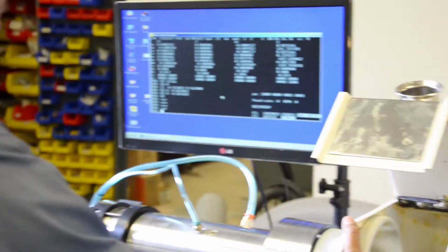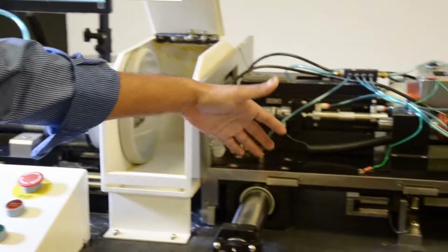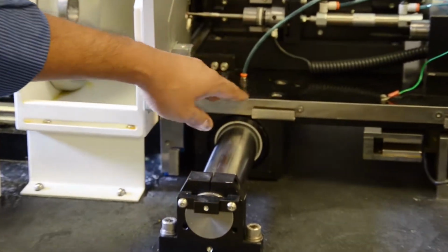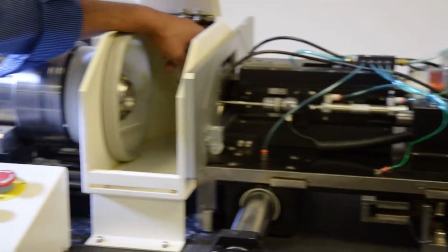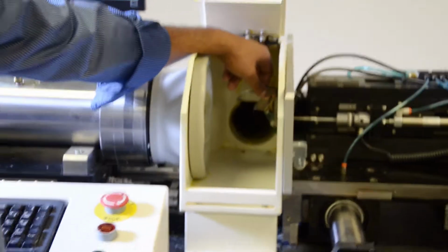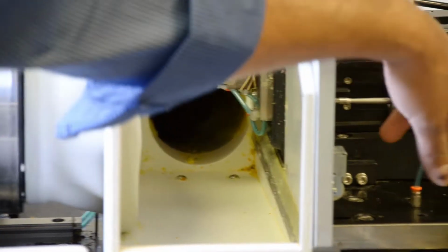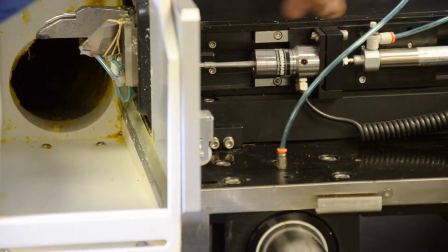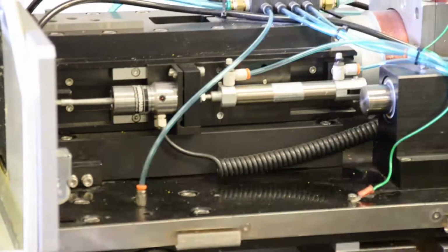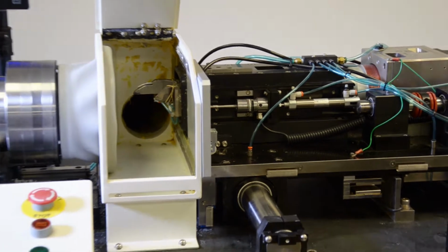So this is C axis, it is moving good. This is X axis. This moves back and forth. And this is our E axis for counterweight. And these are the 2 tool holders we use, and I will show you later how to put the diamonds on it and how to do calibrations when you replace the tools. This one here is a probe we use for calibration purposes, and these are 2 wire coils which we use for those RE axis and Z prime axis.